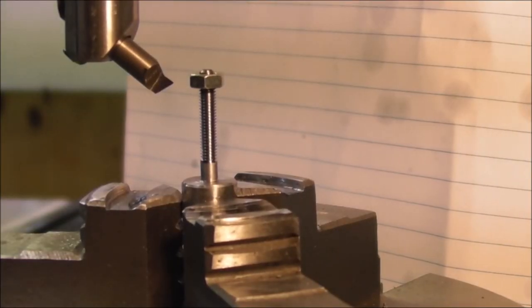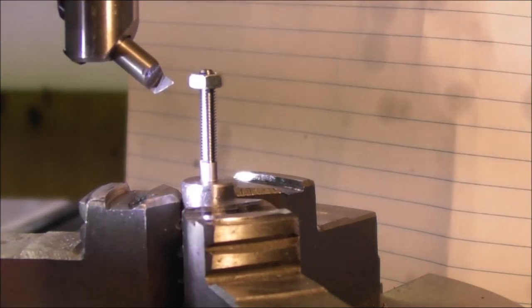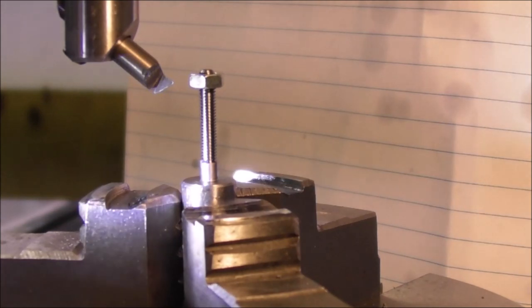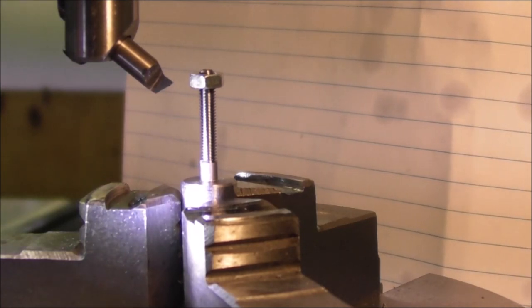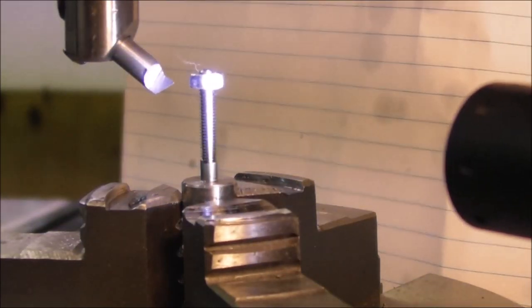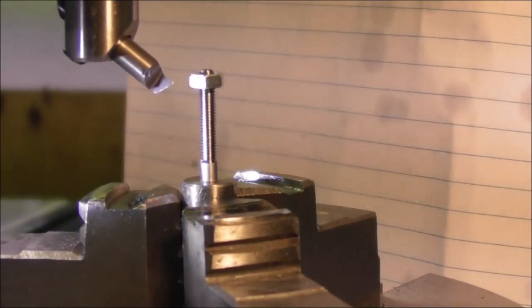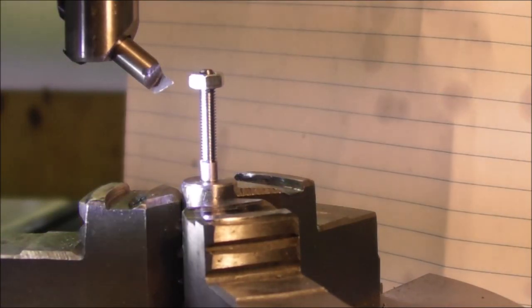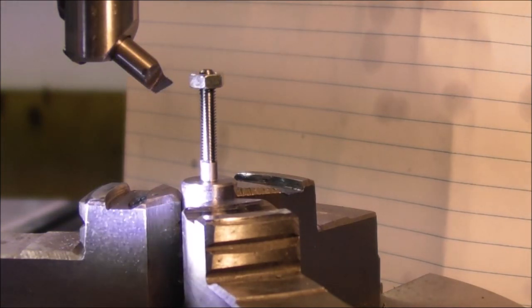Here I'm cutting a very long and slender thread, so you haven't got much work stiffness. This is a three millimeter thread, 0.5 pitch, 0.31 depth of thread, cut in one cut. It's gone surprisingly well — there isn't any noticeable deflection of the work problem with this single point fly cutter, and it's cut a beautiful thread.